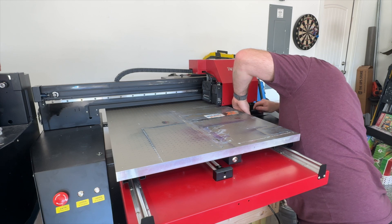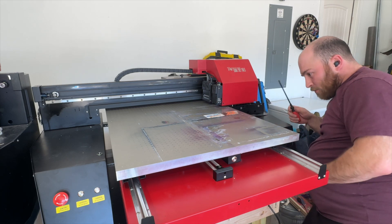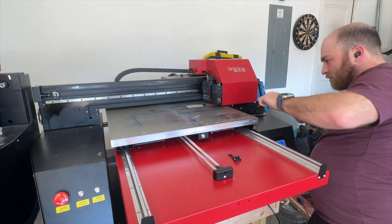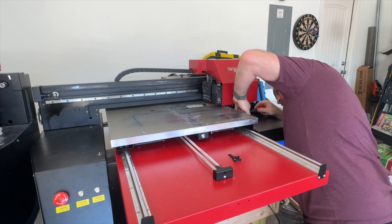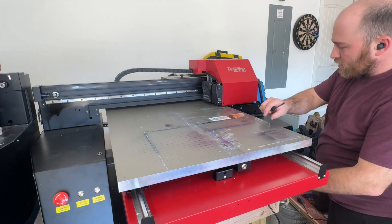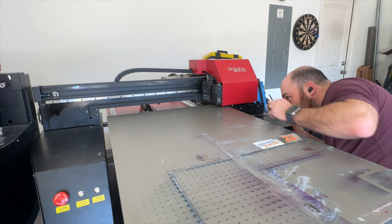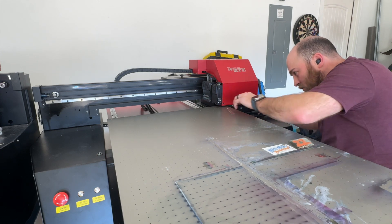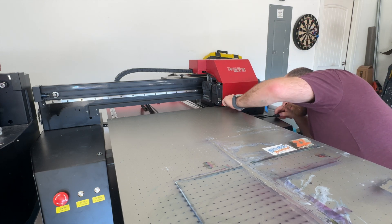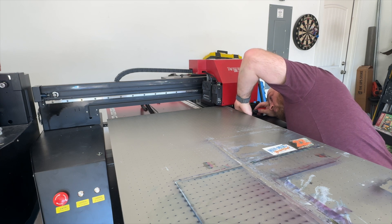I'm going to loosen the screws right around the middle a little bit, then lift it there and get it to the five millimeter mark as well — it'll drop a little when I do that. That should be what you need to do. Right now it looks like the distance from all points is consistent. Perfect — five millimeter gauge fits. I'll check right here at this screw hole just to make sure. Slides in fine in the middle. Checking the last screw hole — and checking the back one last time. The back is a little too tight, so I'll make a slight adjustment.